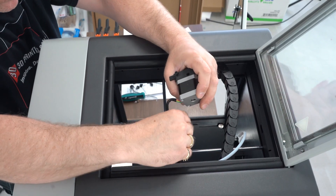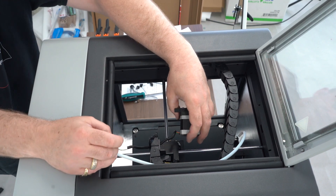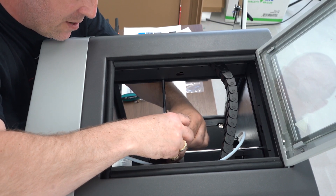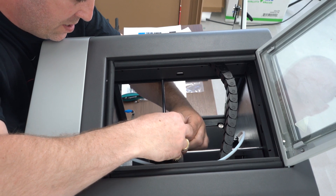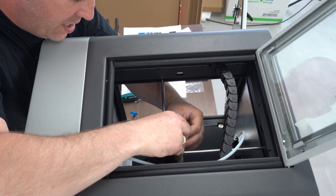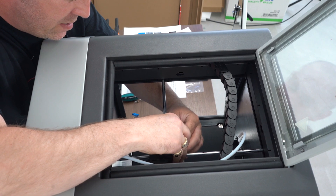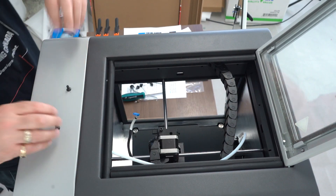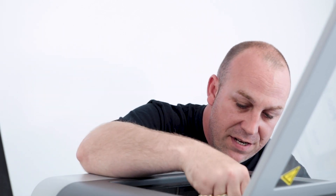Then we're going to run the motor cable through the back of the wiring harness with the daisy chain, and line that piece of PEEK up with the hole for the extruder. It's a little finicky to do it this way. Next step: two provided countersunk screws — I believe around M3 — using the provided allen wrenches. You can use your own if you have them. Keep in mind this printer comes certified for the US and for Canada.